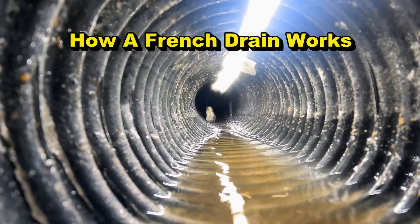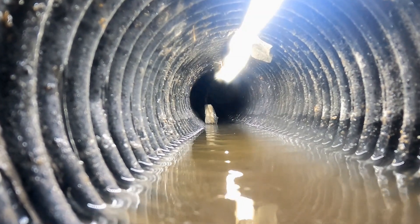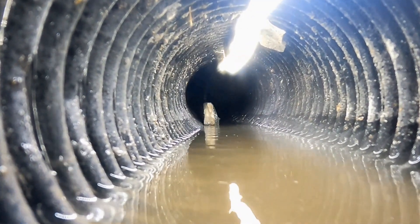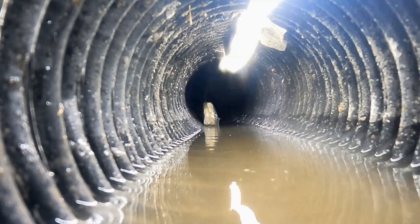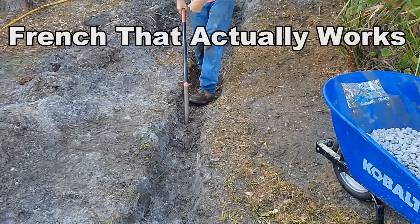During a rainfall event, water rises in your trench and comes through the bottom of the pipe. That's why there's a base of gravel underneath. As the groundwater rises, it comes through the voids of the gravel, floods up into the pipe, and the pipe carries it away. This is called a French drain. This is corrugated pipe and it's slotted — that means there are holes cut all the way around the pipe.